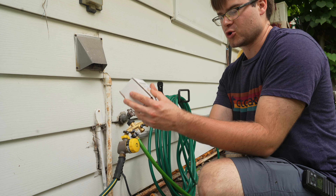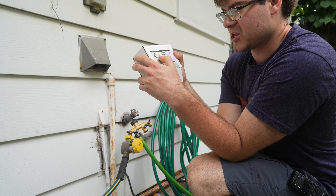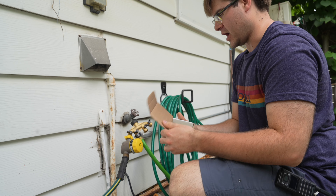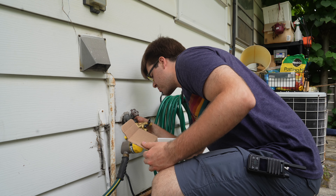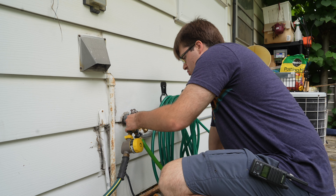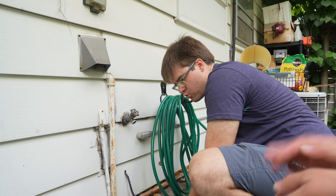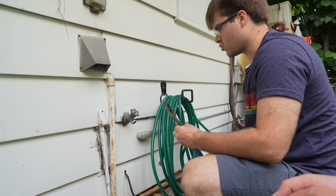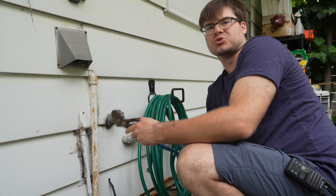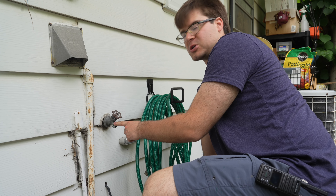These yellow hose washers are guaranteed for three years, and these are supposedly the world's best brass hose nozzles. I'm gonna check here because it looks like there might already be some debris in there that we can get out. I'm going to take this off. I think what we should do is try to scrub as much of this off as we can and reapply our plumber's tape, because this is probably just old plumber's tape that isn't working as well as it used to.